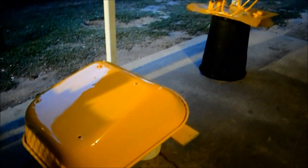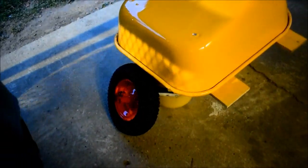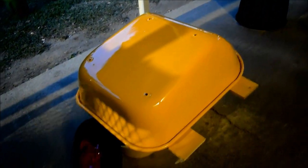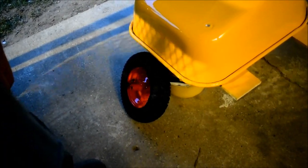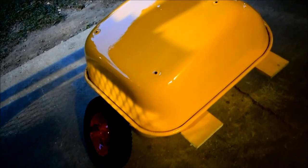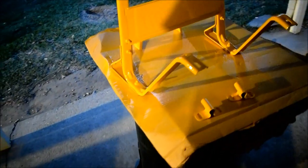So the wheel's red, the rim's red now. That's an IH red. After a clogged paint gun several times. Yep. Next time, the first time anybody ever paints, make sure you use a paint filter to filter out your old paints. Otherwise, you'll get a clog in the bottom of your spray gun if you're using one, and you'll regret it. So that's done, and we've decided.